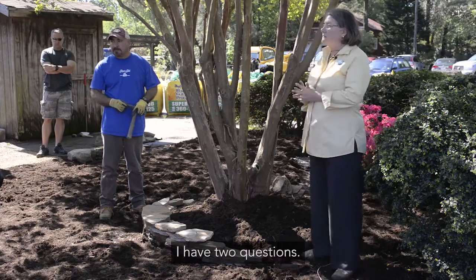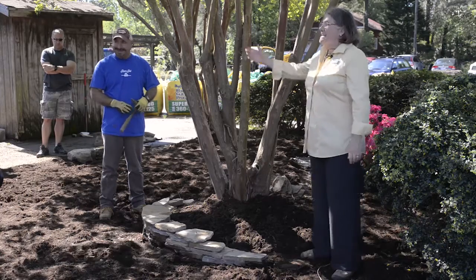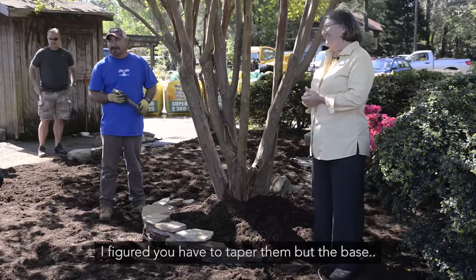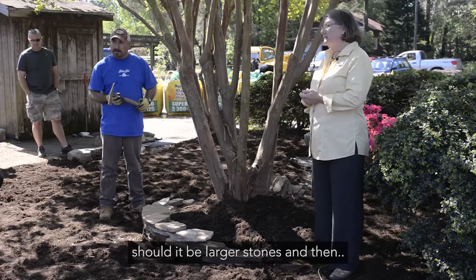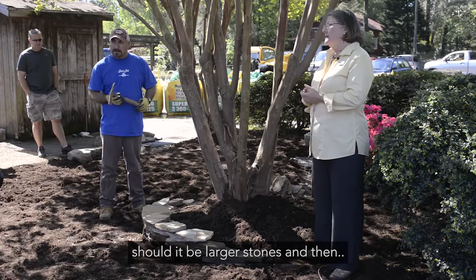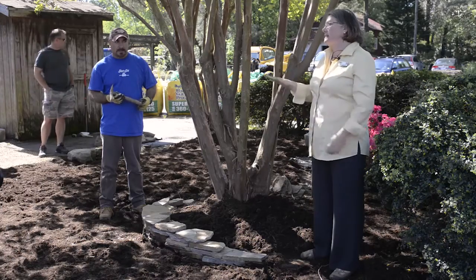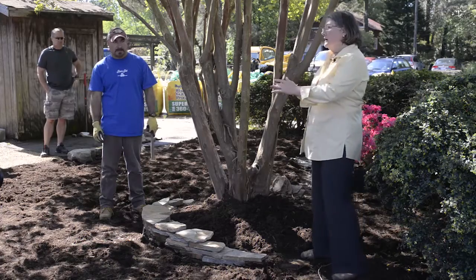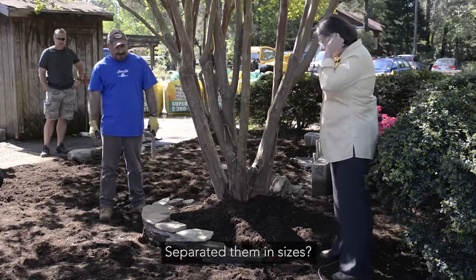What those end up looking like are smile walls — the front of the wall may be this tall, the top of the wall stays level, but you're going up the hill as you come back. The wall starts out pretty tall in the front and tapers back to where you hit grade with a cap — that's when you know to finish the wall. Regarding base stones, it does help to have larger stones as your base, or maybe a couple layers of stone even if they're small.